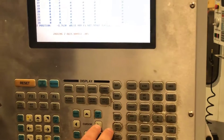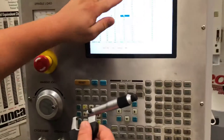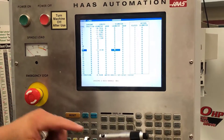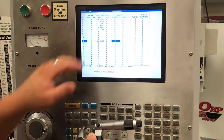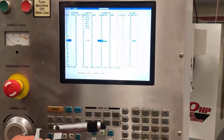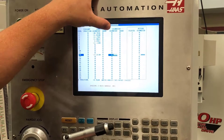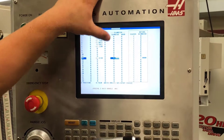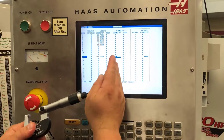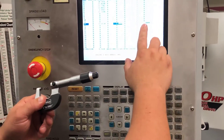From here I'm going to come back to my tool geometry. On the Haas, you'll see at the top it says diameter — I usually call it diametral. That means I have to put in the diameter of the tool, which was one inch. I will type in 1.0 — actual diameter is one inch. If for some reason you came to this page and it said radius, that means the machine is set up for radial CRC — CRC being the diameter of the tool divided by two — at which point I would put that in as 0.5, and then hit input and the actual diameter would still come up to one inch.